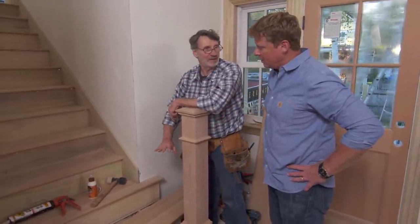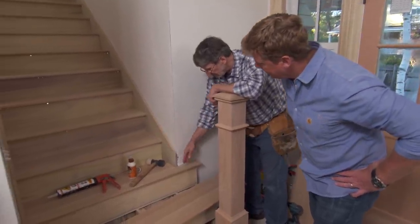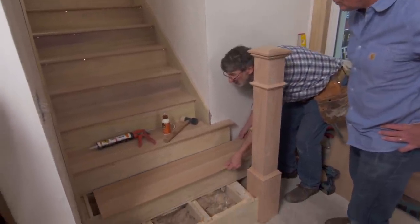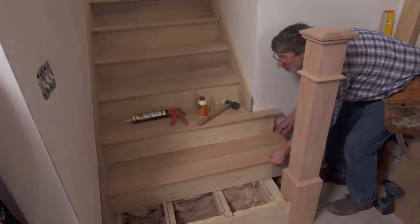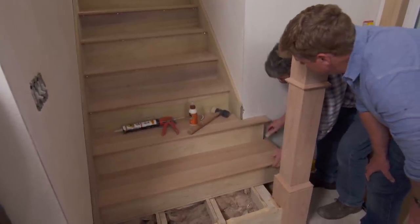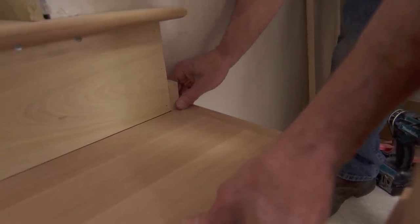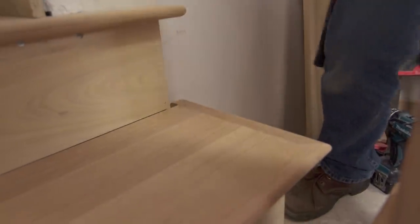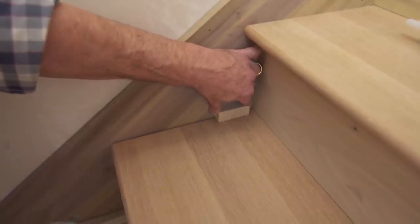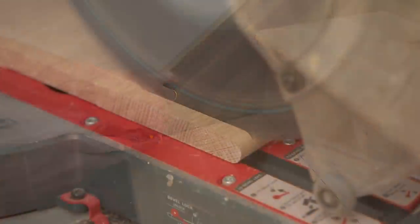Poplar going to get painted, oak going to stay stained? They'll be stained or clear finish. So there are two more treads to go in and they're not between the two skirt boards — as you see with this one, they're going to extend out because of the newel post. So what I want to do is first cut this to length, because if you push it up against the skirt board, the skirt board may not be perfectly square. So we have a little extra wood. I take this block, put it between here, make sure this back edge stays just flush — it's going to go into a groove after we cut it. I take the same block over to the other end, put it up against the skirt board, and use my utility knife just to score the top of the tread — that's exactly where I want to cut it.